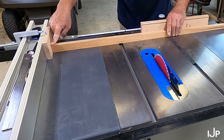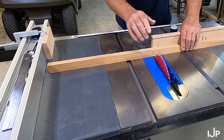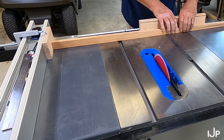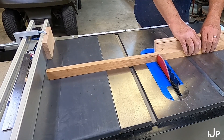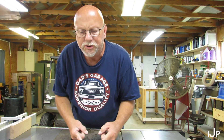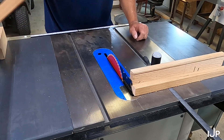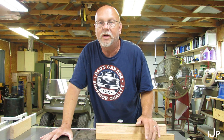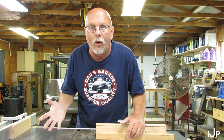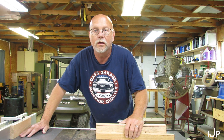So as you see here, I got this butted up against my jig. And what happens when I move this and come down here and cut it — this right here is not against the fence, it's not going to get bound up. Turn the saw on again. Always let your blade stop before you pick up this piece, because if it's going and you pick it up and it gets in there, it can fly up at you.